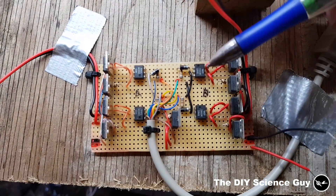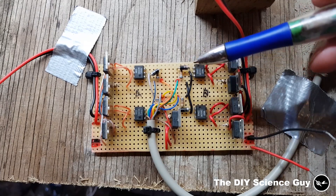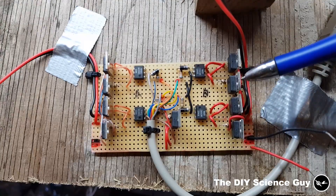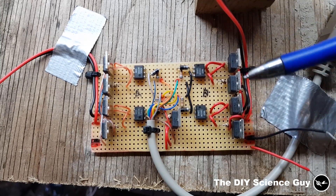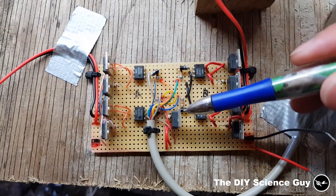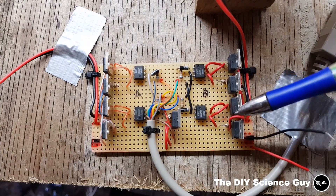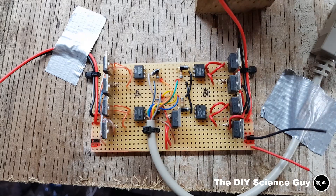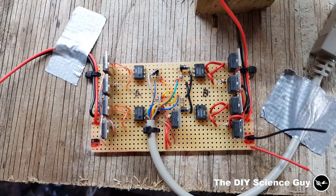Now what this motor control board does is that if the positive side is on this side, then through the diode it will go through this optocoupler, and this optocoupler will then feed these two transistors. This is the transistor for the negative side, this is the transistor for the positive side. These are, by the way, Darlington transistors. I didn't draw Darlington transistors in my diagram because it takes up too much space. I use TIP-121 transistors because they can handle a lot and they're very cheap. And when the positive side is on this side, it will go through the diode, through the optocoupler, and therefore power these transistors, which will make the polarity change. The light intensity sensor is connected to this transistor and is just dropping the voltage when the amount of light increases, so the whole system will respond equally to the amount of light.